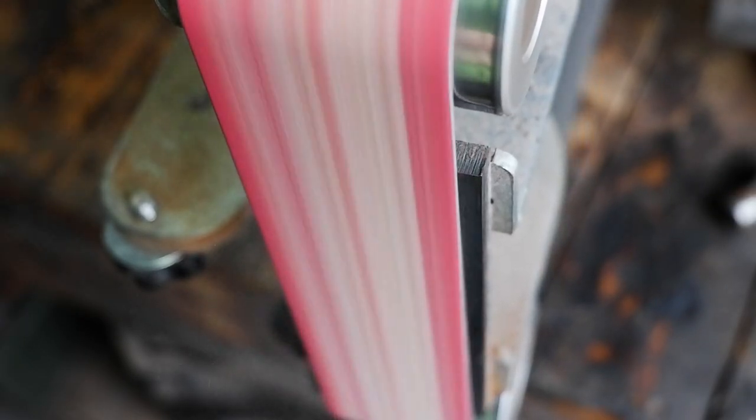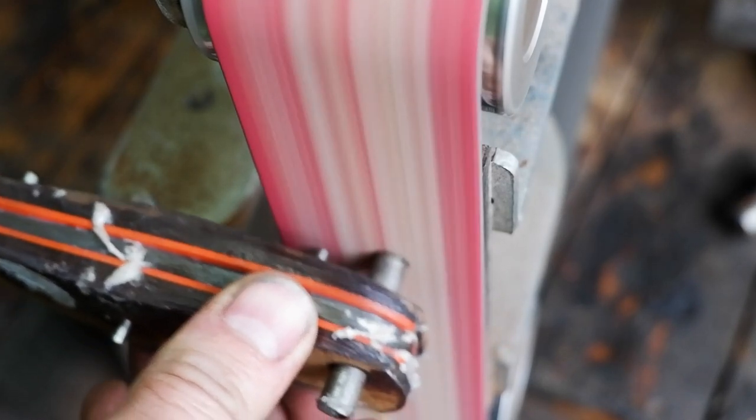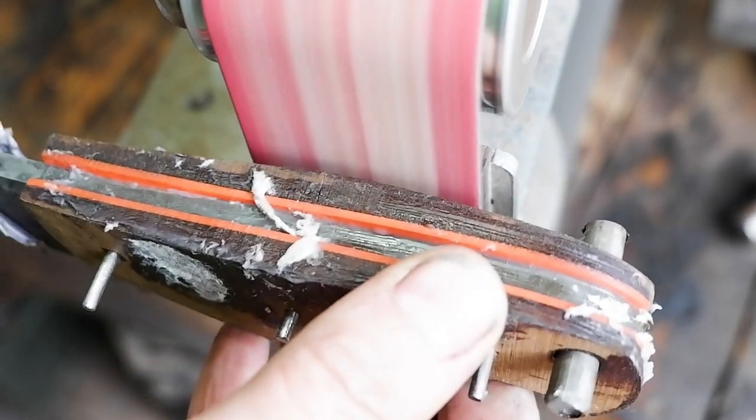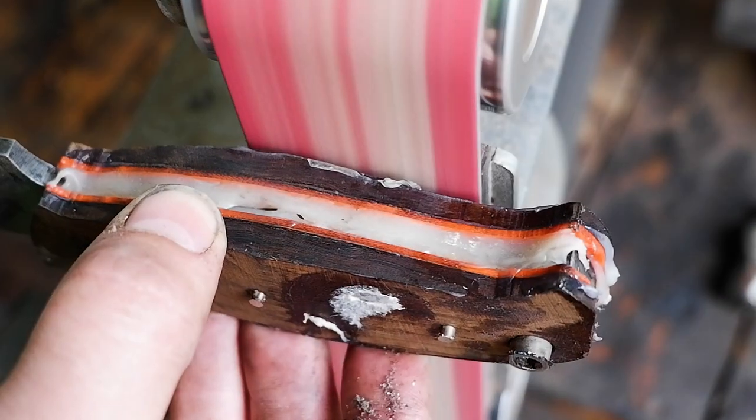Grind off the excess pin material and peen the pins with a small ball hammer. I use two 10mm ball bearings clamped up in the vise to flare out the lanyard tube. Be careful not to over-tighten the vise to risk breaking the wood. Apply just enough pressure to bend the tube outwards.